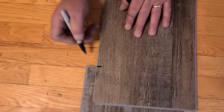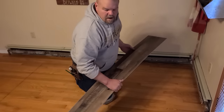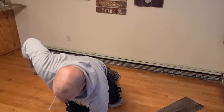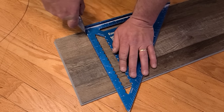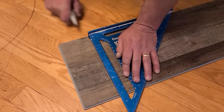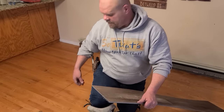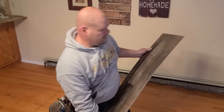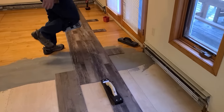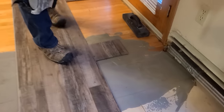Mark right where the tongue ends, then cut it off — it'll get flipped around and go right back into place. There are a couple of ways to cut plank: you can use a utility knife and a square, just score it. Some vinyl planks are harder than others, so you might need to score twice, especially when cutting off little pieces — it should just snap right off. Here's the piece I glued, and you can see it's really secure. At the very end I'll pry that up and scrape the glue off.